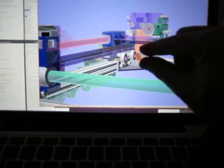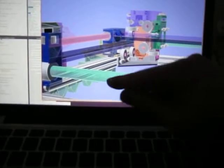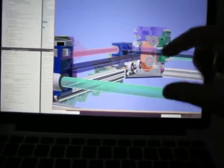I've had to lift this up by 7 millimeters compared to version 2, but fortunately, because this is not a standard E3D V6, although in the CAD drawing here there's a standard E3D V6, I'm actually using a Volcano one, which comes to another 10 millimeters further down. And the print bed comes up into the top area as well. So I've got, I think, about 12 millimeters of play. So I've used 7 of that. 12 millimeters travel on the Z level to bring it up. So that kind of thing.